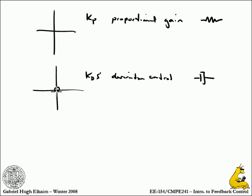The first problem is, what's your DC gain? Right, your DC gain is evaluated at s equals 0. What's at s equals 0? A 0. So what's your DC gain? 0. Okay? Which means you have just attenuated everything out of your DC gain of your system. That's AC coupling? Yeah, actually it is. It's exactly AC coupling. All right? So you have no DC gain. Your DC gain has gone to 0.